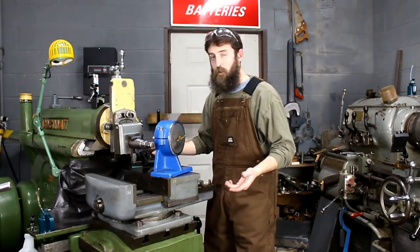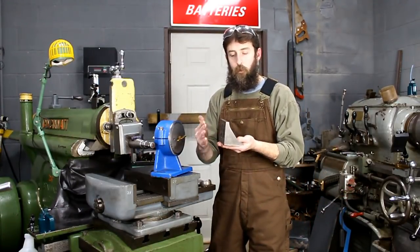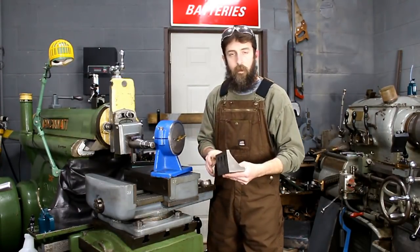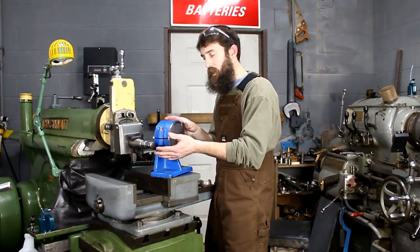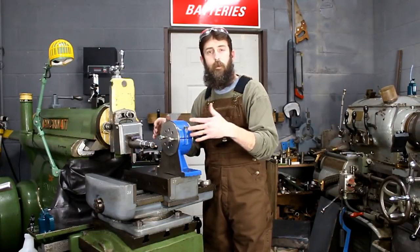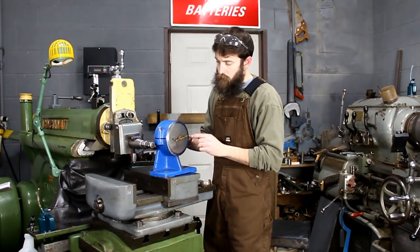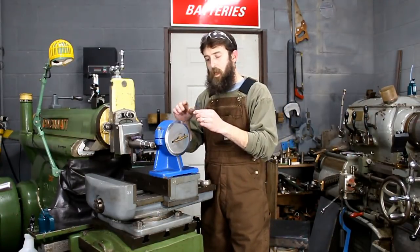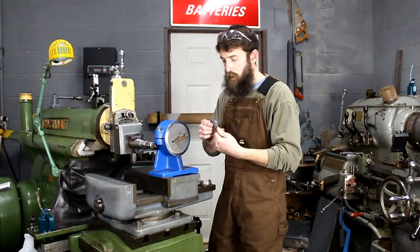For those of you who aren't familiar with it, it is what the name says — an indexing angle plate. Most angle plates are just a fixed cast iron 90-degree surface. If you need to hold your work vertically, you bolt your work to it and bolt it to your work table. But this one's different in that you can rotate it 360 degrees, bolt your work to the surface, clock it whatever amount is needed and lock it back down. We scribed 360 lines on this back bezel and made a vernier scale — this is just a PVC prototype.